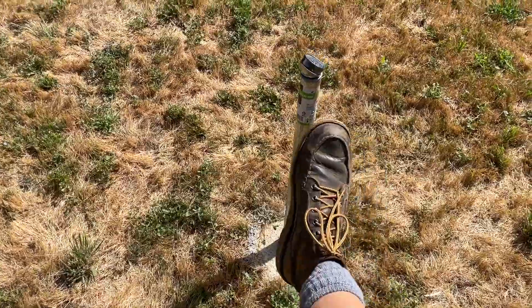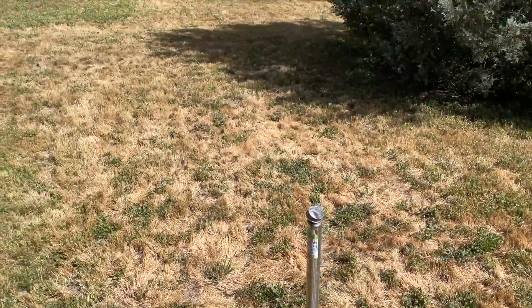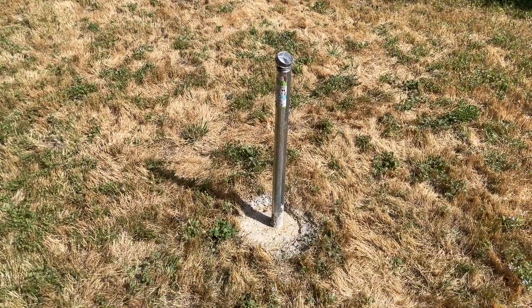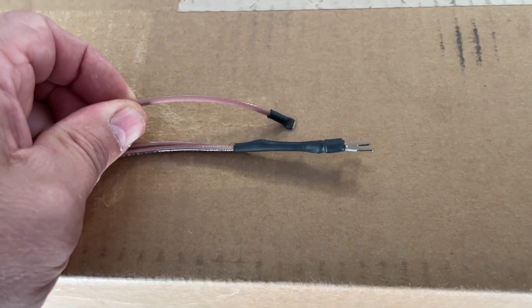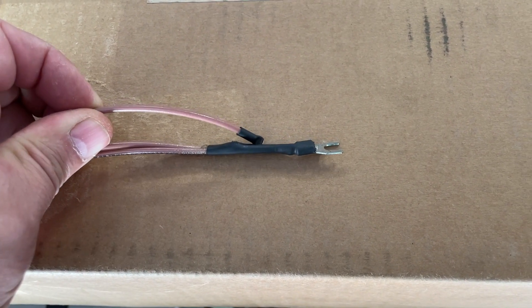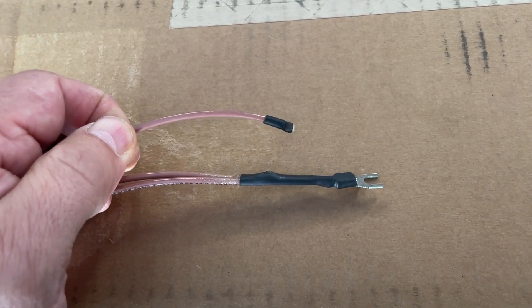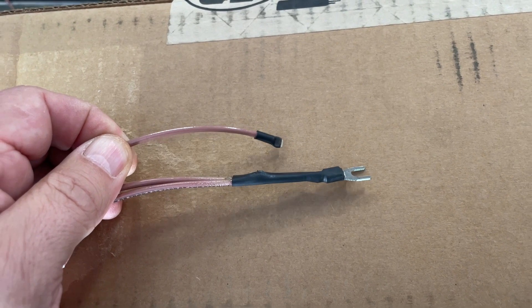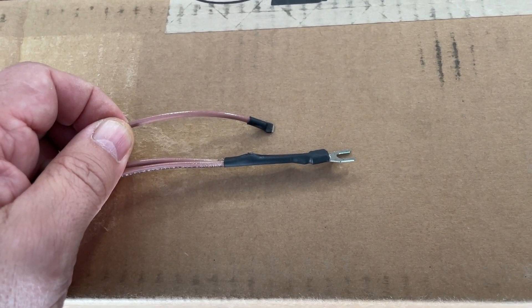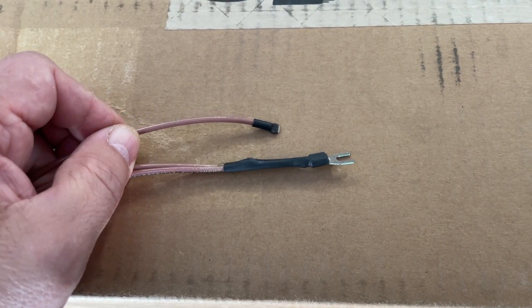It's super solid. My other antenna is on the side of the house over there. You can see what I've done here: I soldered the end on, then put heat shrink on it. It's just gonna lay out open. I put some heat shrink on it to try and keep the water out so the stranded copper wire doesn't get all corroded.